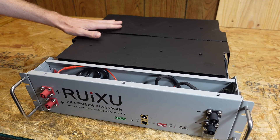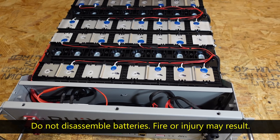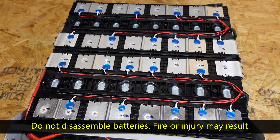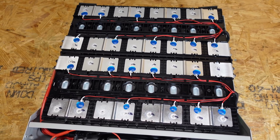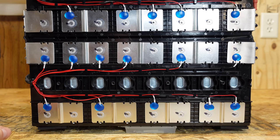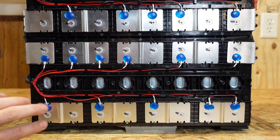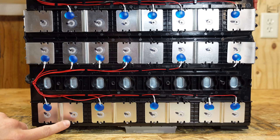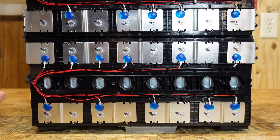There is a piece of plastic protecting the battery from the top lid should the battery be crushed. Look at that battery pack — this is probably one of the cleanest and nicest laid out rack batteries I've seen so far. Everything just looks absolutely perfect under here. We have two rows of eight cells, all wired in series. Each cell is 100 amp hours and they are laser welded in place with an aluminum strip — you can see very nice laser welds. Each one actually has a mark on it suggesting they were individually checked for quality.